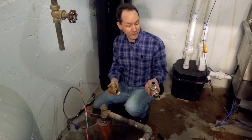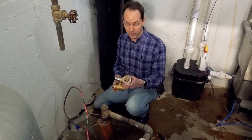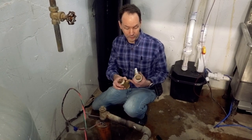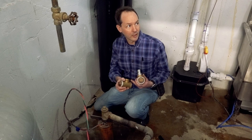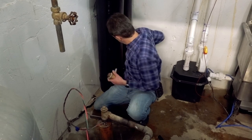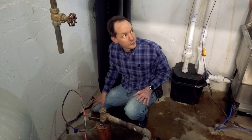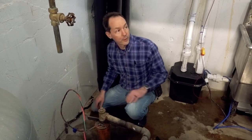It should be pretty easy because it's a plastic pipe, so this shouldn't have too much purchase on it. Once this is off, I'm gonna clean it with a wire brush, put on new tape, new pipe goop, and spin one of these on. I'm not sure which size it is — if it's this size it just goes on; if it's this size, I've got to transfer the fitting over, which will take another five minutes.